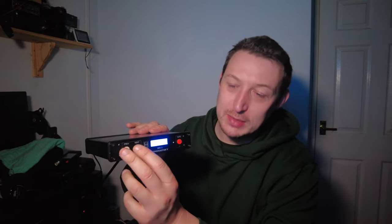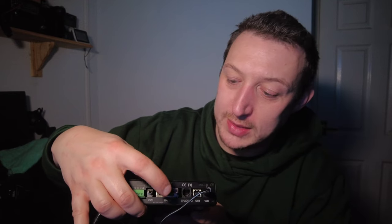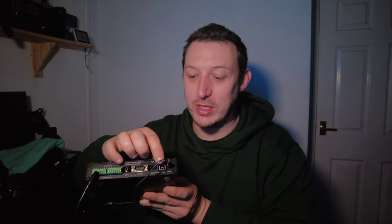With the buttons on the front you can either change the antenna manually, or it plugs into the CAT interface - you can connect almost any radio into it. On the back you've got a serial port for CAT connection, an Icom CI-V port, a LAN port so you can control it from a computer, and a USB port. If you've got a Flex Radio you can plug the USB port straight into the radio. It switches relays as you change bands, setting them dependent on which band the radio is on. You can set it to switch transmit antennas and also do receive antenna switching as well.